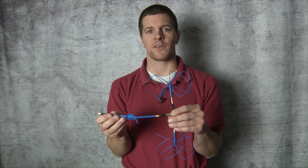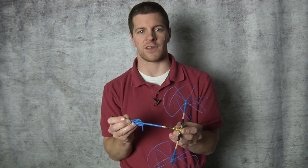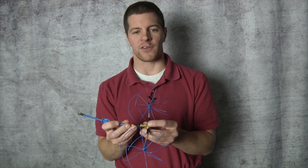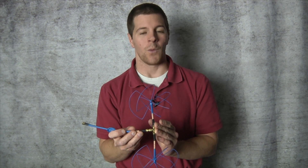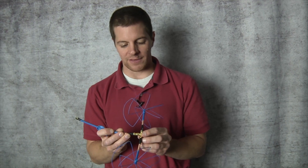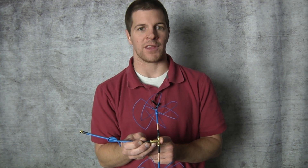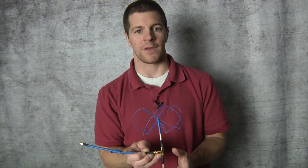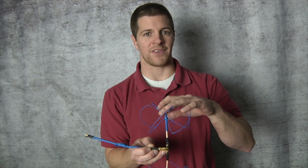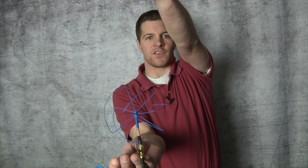At first glance this appears to be just two mad mushrooms stacked on top of each other to a T-junction. You might notice that a few people have been selling this T-junction as cheap diversity, which is a blatant lie. The truth is you can bring two antennas to a T-junction but you don't get diversity — you get changed performance. In this case, the two antennas stacked on top of each other increases the gain from just 1.5 dBi to 4.5 dBi.